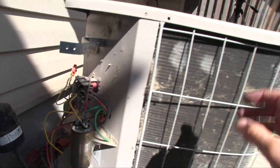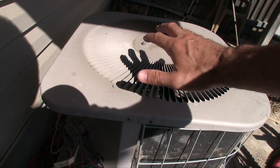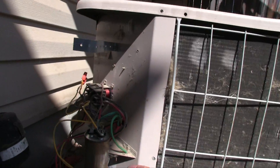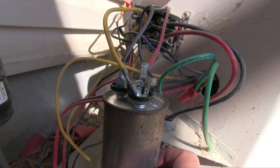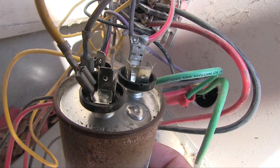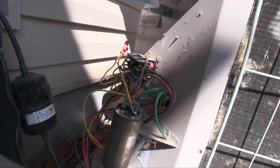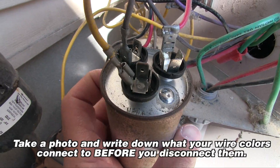On this unit, the renter was saying the fan seizes up. He greased it with WD-40 because it was buzzing and not really moving, and the compressor wasn't going well either — that's a sign of a bad capacitor. We did a video on this before. You can see the bulge — see that dome on top? Super simple to replace these and get it going again. All these connectors are not that confusing if you watch my other video. We're just going to swap this out, put it back together, clean out the dog hair and dirt, maybe comb the fins to straighten them, and this thing should work perfectly.